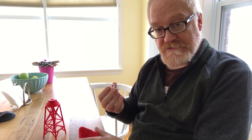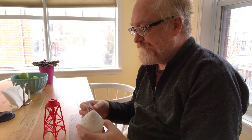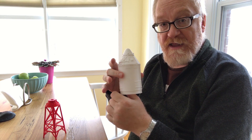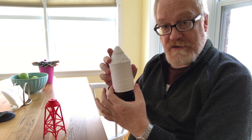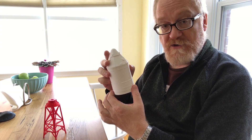There's a lot I'm going to do differently from my Saturn 1B build — I am not hand-making body tubes. Fiberglass work and all that expensive stuff will be minimized. The advantage of doing a lot of this as 3D-printed parts is that I have the materials available and can defer some budget items until later in the build. So we're going to have mostly 3D-printed components. Whereas with the 1B I made a fiberglass body tube with an 8-inch diameter, for this one a 3D-printed body tube is fine — it's fairly lightweight and allows me to add a lot more details. I plan on adding more details as I go along and will be publishing the 3D models so you can build your own.